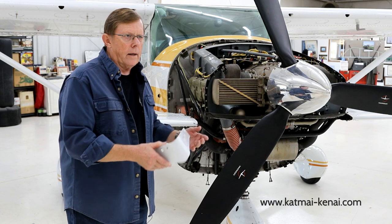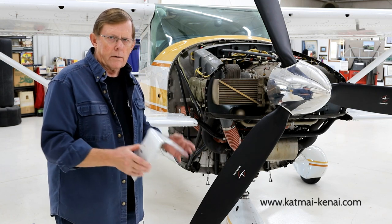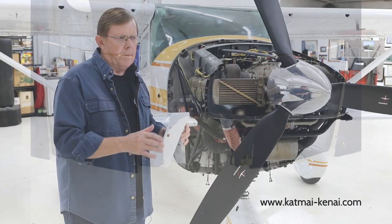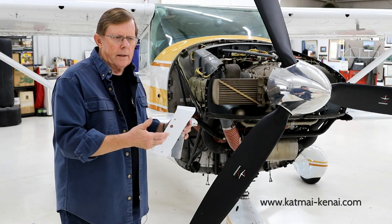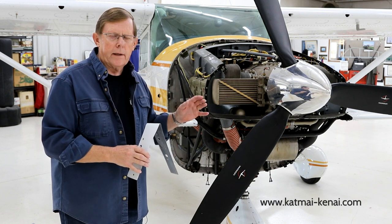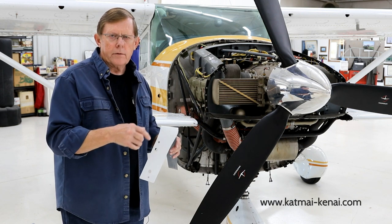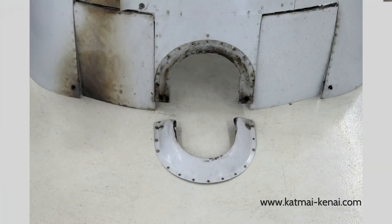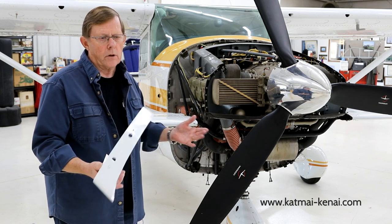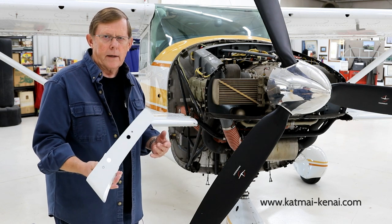The bottom cowl has had a modification we've done over the years. On the early cowls, there's a fairing that goes around the nose strut as it comes out of the bottom cowl, and that fairing is kind of tight. In the past we just left that, which makes getting the cowling off a little more difficult because you can't work it around very much. What we ended up doing is taking that fairing, drilling out the rivets, and putting in screws with rivnuts, so we can now remove that fairing. This opens up the gap in the lower cowling and makes the lower cowl much, much easier to get off. The earlier airplanes are all that way, so if you haven't done that modification, I'd recommend doing it in the future.